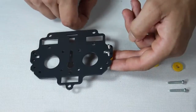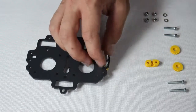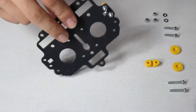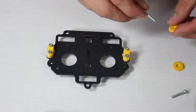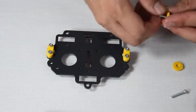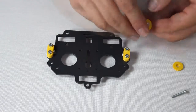The printed parts are then screwed on, and don't forget the washers before applying the nuts. You can use the spool holder to tighten the nuts. Once you've done this, apply bolts to the printed cogs. Again, these have a predefined direction. The bolt heads must fit into the hexagon-shaped recesses on the cog.